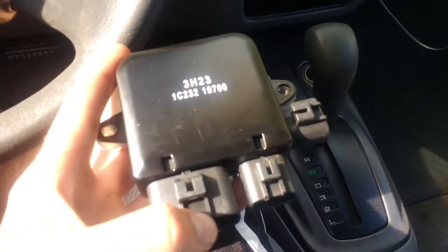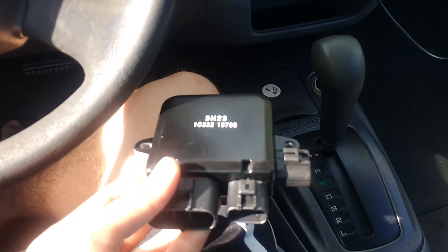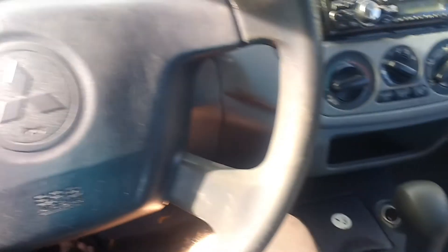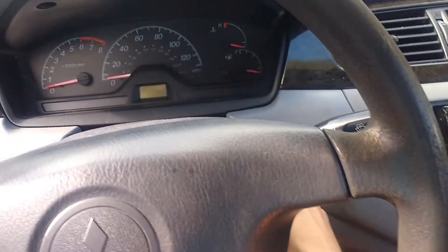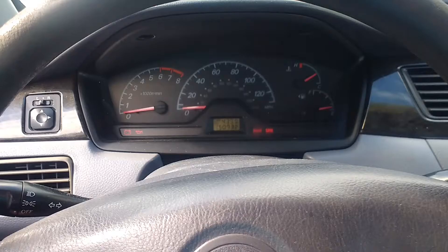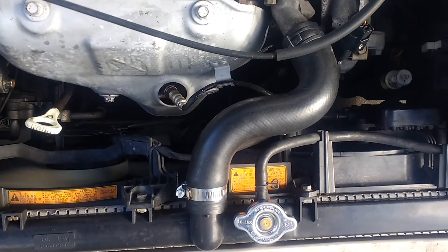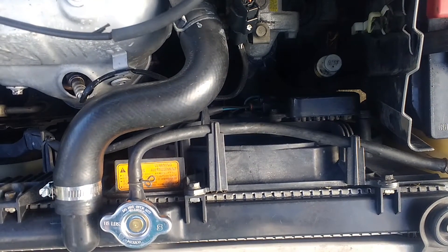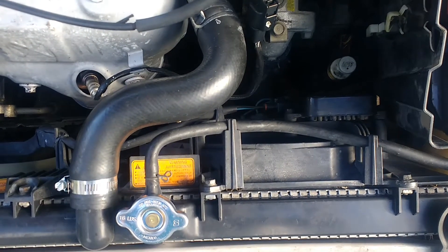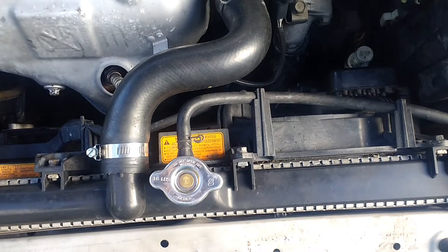Five days have passed and now the new controller is here. Looks like the correct one, so that's good. I've driven the car a few hundred miles — I drive this car every day — and now it's basically doing a thing where just whenever the ignition's on, the fan's on. Both fans, running at different speeds and slowing down. It's bizarre. Let's go ahead and change out this controller.